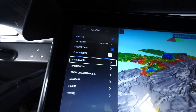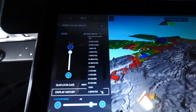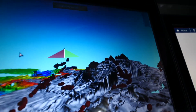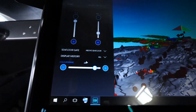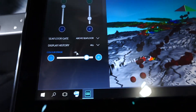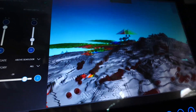I jump into the chart and take a look at water column targets. I'm only looking at targets from the last five minutes, so if I extend that to all — there they go, these are all the fish marks. Well, not all of them, because I'm filtering out — I've got colour erase set to minus 26. So anything with a signal strength weaker than that has been filtered out. These are only the big predatory fish: things like snapper, kahawai, and even kingfish.